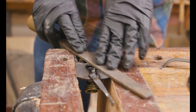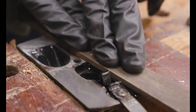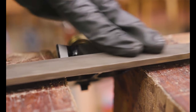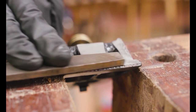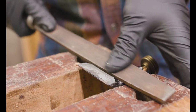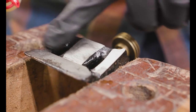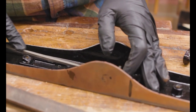The frog was not flat — it needed a good bit of work. So I spent a good bit of time flattening it. Any Japanning that leaked over the edge I can get off with a file, so I spent time flattening any surfaces and cleaning up edges where Japanning came around. Being able to use a file accurately and cleanly to make these pieces fit together is a good skill to learn. I'm oiling any open metal surface as soon as I get to it — we don't want any rust.